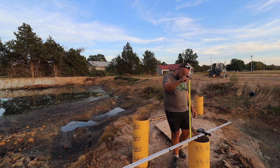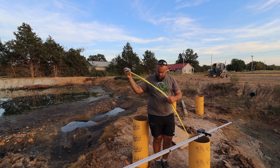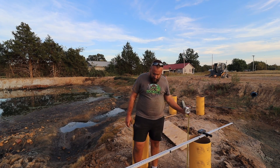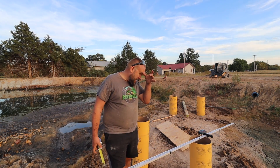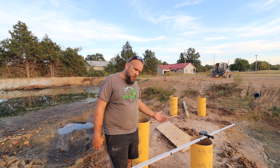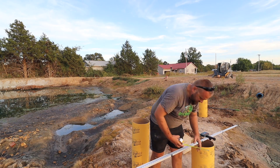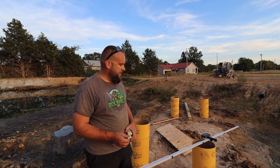Our concrete here is going to be four foot ten inches — there's ten inches where the hole is deeper than the bottom of the tube, and two foot three inches above ground, so there'll be two foot seven inches of 12-inch diameter concrete below grade. I think this is going to do it. I've had concerns about putting this out in a pond where everything is going to get soggy, because water level is going to be about a foot up these year round, maybe a foot and a half. But I think this is going to do the job.